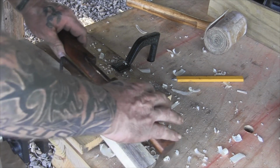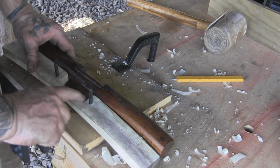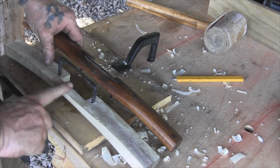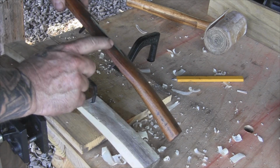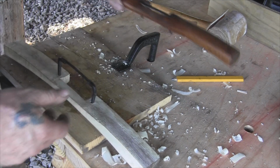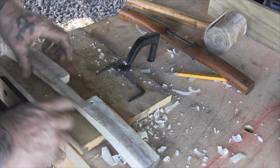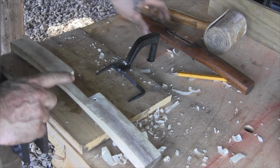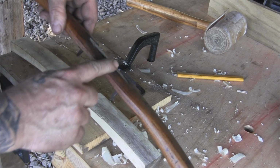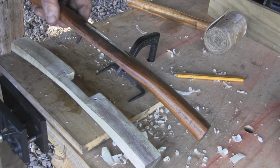Once we have our holes in here and we've got our blade lined up, we know we're going straight down here. Now we've got a little bit of a recess right here, an angle here, a bevel line that allows that blade to cut. So we got to take this out for the moment, and we've got to cut that bevel in, and we've got to be really careful with that bevel, because whatever we expose for blade right there is going to dictate the depth of our cut.